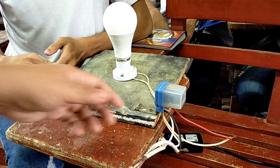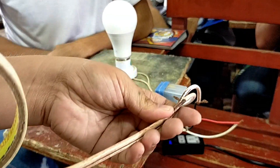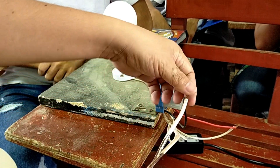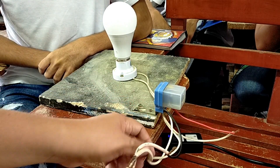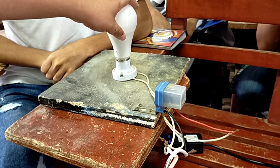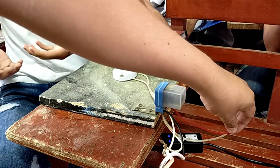Please familiarize the diagram. The diagram shows the AC cord: one terminal goes to the black, and the other terminal goes to the white of this portion as well as to the bulb. The other portion of the bulb connects to the red wire.